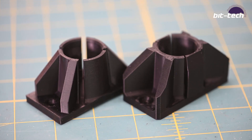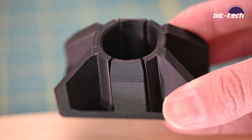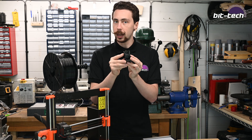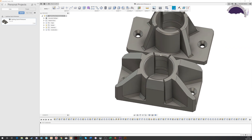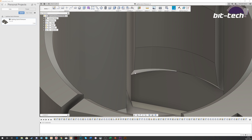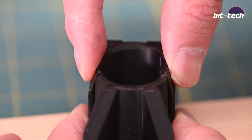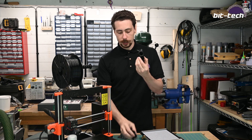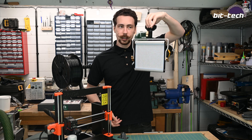There are a few key revisions with this one. Namely, I've reduced the size of the clip overhang, and I've also made these ribs along the outside much larger, taking them all the way to the edges, which means it should be a lot stronger. And the biggest thing actually is these clips are no longer round, both on the inside nor on the outside. I've made them flat on this side, so they're going to be easier to flex out. But also on the inside I made it round at the top where it mates with the round surface, and then square underneath that. I used the sweep tool to convert the overhanging lip into a nice gradient so that it would print smoothly. That means these prongs are significantly more flexible than the previous ones, despite being thicker. So they should be very strong but at the same time a little bit more flexible. And the result is a much more pleasing fit — more than strong enough to hold a light, even if I wiggle it.